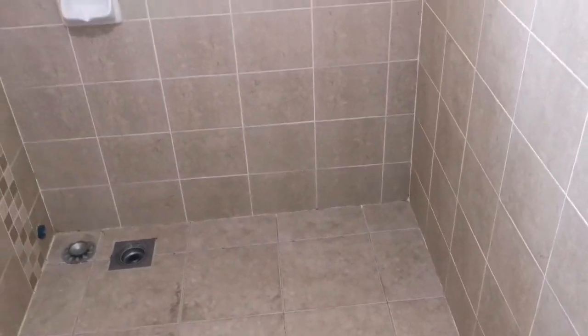That's why the water can seep in at least to the second level, and that's why the first level has leaking. So this is very clear, but you need to clean the floor first before you can see it. Yep, so later I'll show you how to apply the filler and white cement.